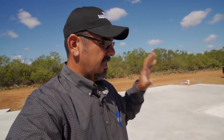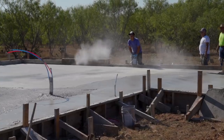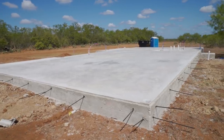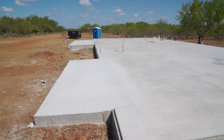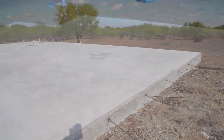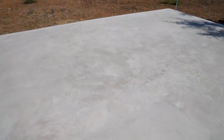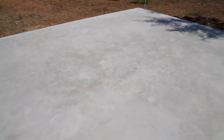There are multiple ways to add color. Integral color is probably the easiest way to do it, but we added color hardener to the surface. The customers did not want just a solid one color all the way throughout, so we added a white and a gray to get kind of a marbling effect, and I think it turned out pretty good. You can see it is very light because we added white, but it has some marbling effect because we also added gray. Once we seal it, those colors are really going to pop.